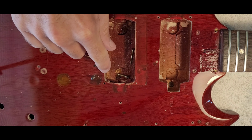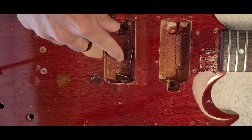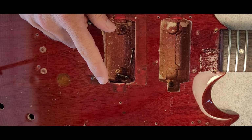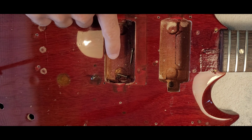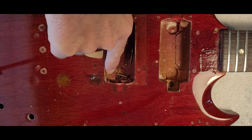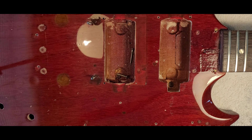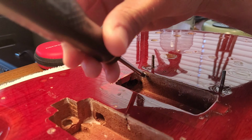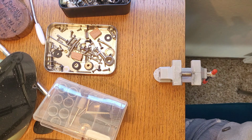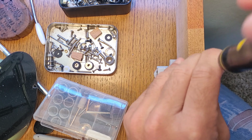We're going to put the screw back in, mark the length off, and then we're going to lop the head off the screw, flatten the very top of the thread, and cut a flat head screw slot, a very small bit, into the top. Then we use a wire up against it, slot that in there with a spring so that we have good contact, an anchor that people can use and also remove, and it'll be almost completely flush against the wood, so you'll only see the wire protruding. If you look inside, you'll see the polished head of the threads with a little notch for a flat head, and it's fairly loose fitting. It's just meant to anchor it.